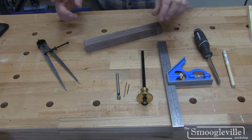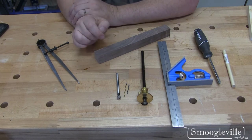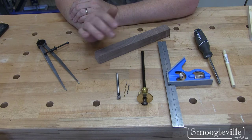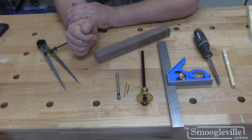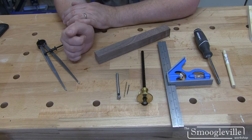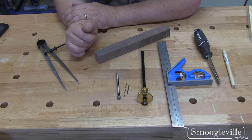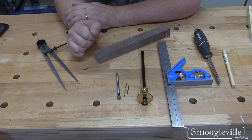I would recommend doing this on a drill press. That'll give you a more accurate cut in the hole. If you don't, then you just have to be really accurate with your hand drills, and try and figure out a way of getting those through very, very straight. But I would go with a drill press if you can, because that will always put a nice accurate straight hole right through, no deviation. All right, so